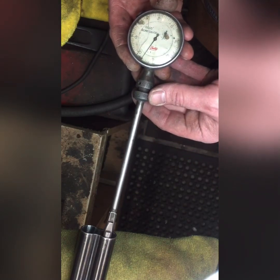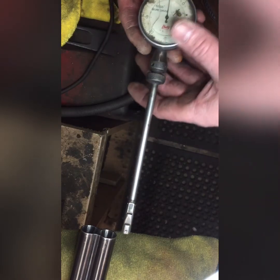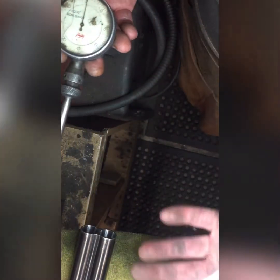So it's the restriction — how much smaller the choke is than the bore. In this case it's 18 thou restriction, which is near half choke.